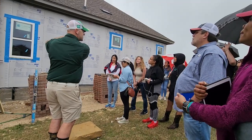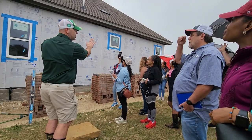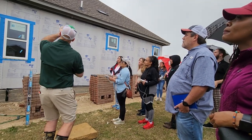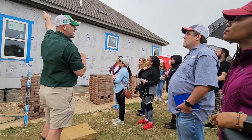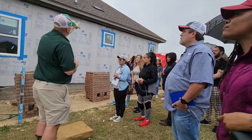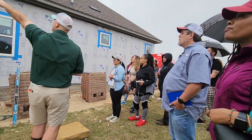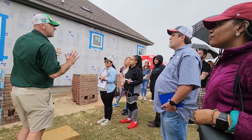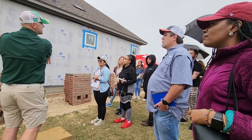Where you have your usual soffit board with the little perforated holes underneath, when the wind hits the wall it goes up the soffit and that pushes the heat out of the attic. If you have your cornice vents here, then I can put a whole lot more insulation in the attic without having to worry about the wind blowing that insulation back. I'm catching the air that's up on the roof versus the air underneath the roof.